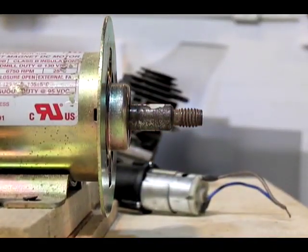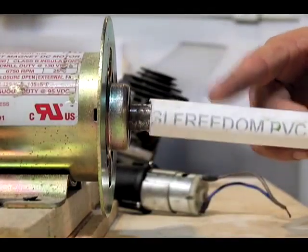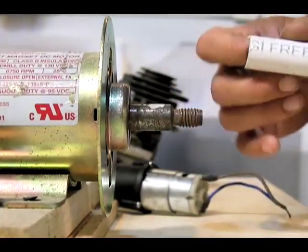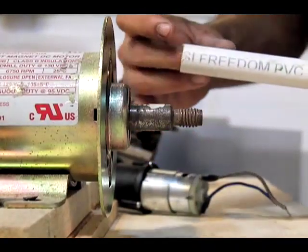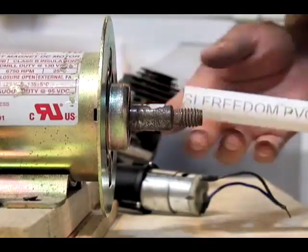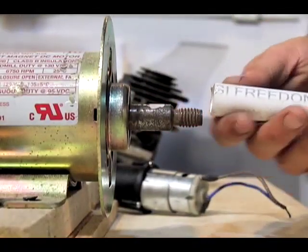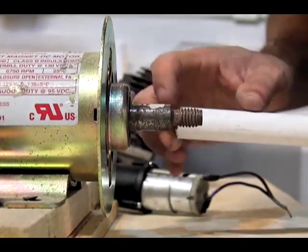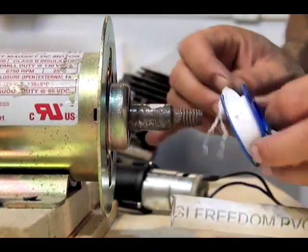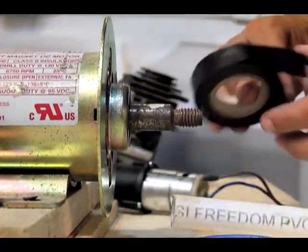One thing I found is there are two different types of PVC pipe. There's CPVC, listed as half inch, which is actually smaller than regular PVC — it has a smaller diameter. CPVC can actually fit tightly inside of regular PVC, so much so that you can add a little glue and use it for an air or water connection without even needing connectors. For this video, I'm going to show you how to use just regular PVC pipe and a little bit of Teflon tape — the stuff you use for plumbing, about 20 to 30 cents a roll — and standard electric tape.